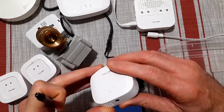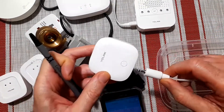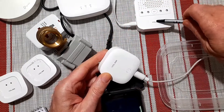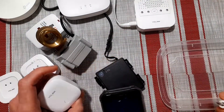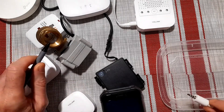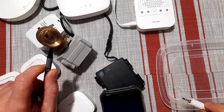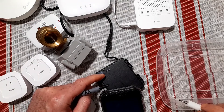This is what they call a probe sensor — I call it a probe sensor because it has an opening at the bottom for a water probe cable. This cable has been previously put in water, and it pairs with both the alarm system and the valve itself. Now if you'll notice, when it alarmed, it opened the water valve. The reason it opened the water valve is because when it was paired originally, the valve state was open. And if you want this valve to actually close when you detect water, then you need to make sure that it's paired in the closed state.